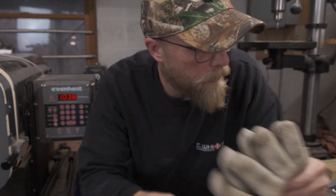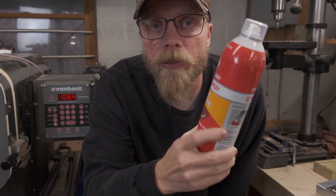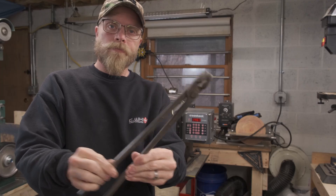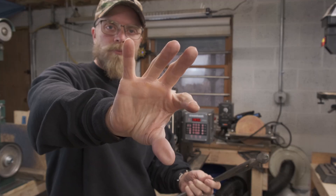I don't know who needs to hear this, but 1950 degrees is generally considered very freaking hot. You need to take precautions when pulling something out of a kiln at those temperatures. Eyeglasses — good idea. Some kind of heat gloves — also a good idea. Your skin cannot take 1950 degrees; it will melt like hot butter and smell really bad. You'll also want a fire extinguisher or easy-fire spray can nearby. And most importantly, something proper to grab the knife with — not your bare hands. To recap: 1950 degrees, or 1930 in our case, is very hot. Take precautions.